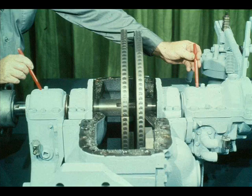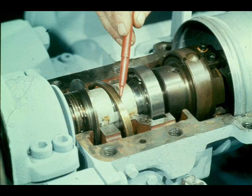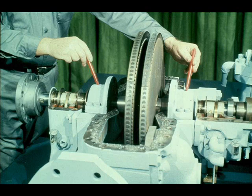The weight of the rotating assembly is carried in two bearings, enclosed in these bearing caps. The bearing on the coupling end of the turbine is called the inboard bearing, while the other bearing is the outboard. After removing the bearing caps, you can see that this turbine is equipped with sleeve bearings, lubricated by the oil rings being pointed out. You can also see a ball bearing that serves as a thrust bearing, preventing excessive axial movement of the shaft during operation. The other two housings, one on each side of the wheels, are packing housings. They enclose packing designed to prevent steam leakage out of the case along the turbine shaft.